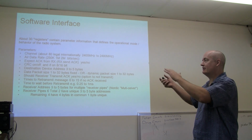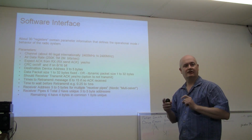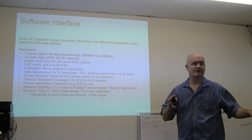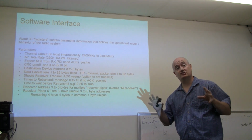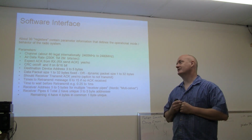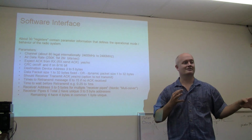So, okay, channel. We're going to have to match our channels on our link to talk from device A to device B. And in more elaborate scenarios, you might have something that switches channels, and they have a thing that I won't go into called Frequency Agility Protocol. You can get on Nordic's site for that.